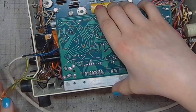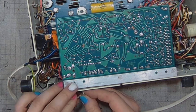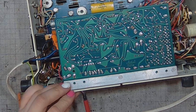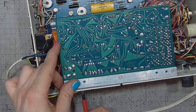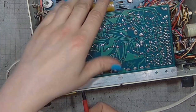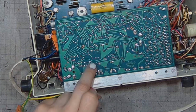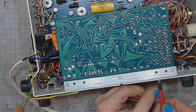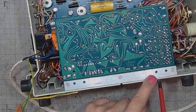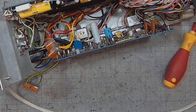Of course, for any manipulations I'm doing on the device, if I have to grab it by hand, I disconnect the power first. So this would be the 10 volts DC. And all I want to do now is connect a potentiometer between the 10 volts DC and the ground with the wiper on the pin under test.